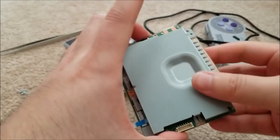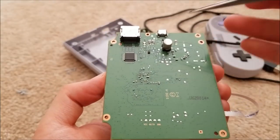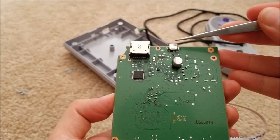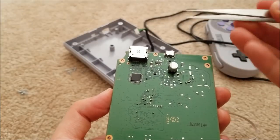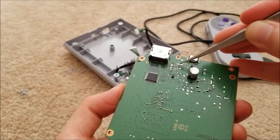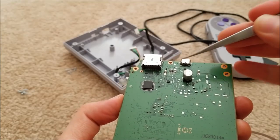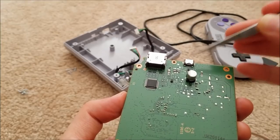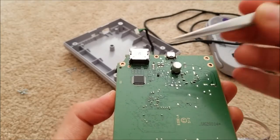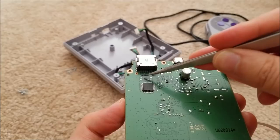A little snug, but carefully remove that and we can see the bottom of the board. We have the main DC filter cap for the 5-volt rail, right near the USB power connector. This also does data — that's actually how you install the Hakchi mod, through the USB interface. We have what look like ferrite beads for protection, probably between the grounds for the system and the USB side. There's a resettable polyfuse for power protection, and here's the HDMI driver chip right next to the HDMI port with some termination devices in between.